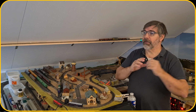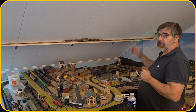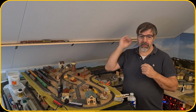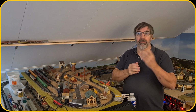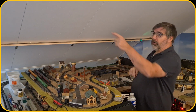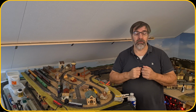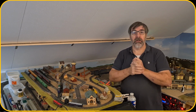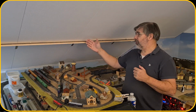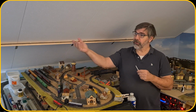Now it's a cloudy day, so I don't have that problem at all, but this sensor here is very sensitive in regards to receiving infrared lights or bouncing lights of this white ceiling. So I did some tests, and that is something what I'm gonna do today. I'm gonna add some black paper here and over there as well to cover the reflection of the wall. That is to resolve that the sensor will just go off at a certain point, and that when the train is traveling here, it sometimes stops, which I can actually show you in a moment when the train comes back.